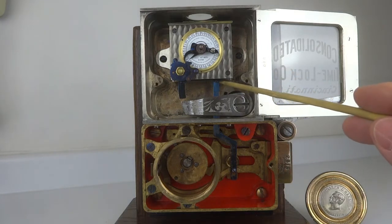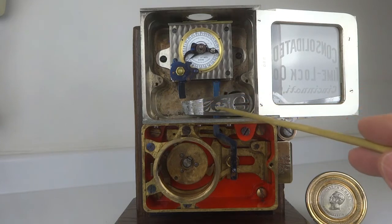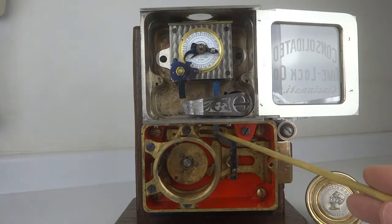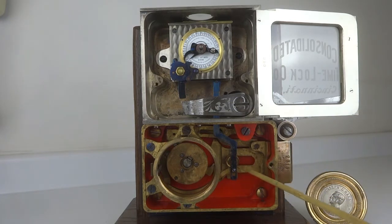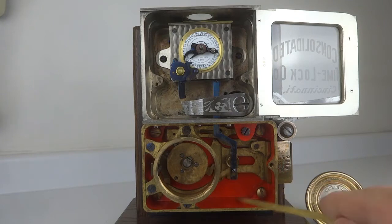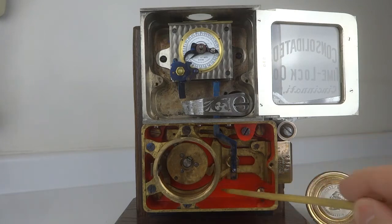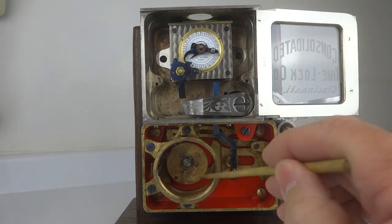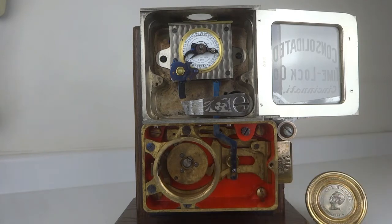You'll see this blued piece of steel. It goes behind this lever here, which is part of the Benjamin Flint dogging system, and then comes through here and then connects to this piece here, which is now pretty stiff. I can't move it. And that piece is connected through this circular piece that goes underneath this housing, which houses the wheel pack, which you can see over to your right here, and is connected to a secondary fence here.